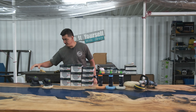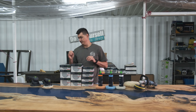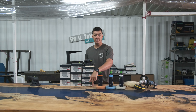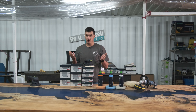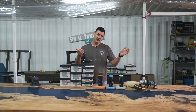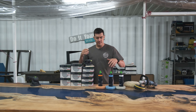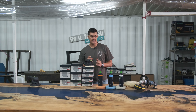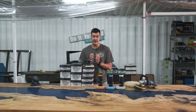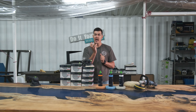We start sanding with 80 grit sandpaper with our Rotex machine. Moving to the next part is super critical — it all depends on what color epoxy you're going to use. If you're going to use a solid color, you can use a normal orbital sander, and you don't need to polish your table. You can go to 400 grit and oil your table — you'll have the perfect finish. But for our style of building, we like using transparent colors, meaning you need the following steps to be perfect. A normal orbital sander is too unstable and will always result in swirl marks.